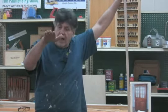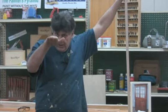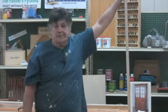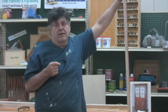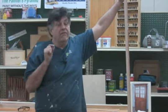All right. So once, and I would still just go just a little bit below, meaning a little bit of an overbend, because I'm going to get a little spring back, not much. And it's kind of a trial and error thing. But the biggest thing I want you to get is that we left this material nice and heavy right up to the last minute before we are committed.